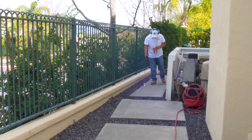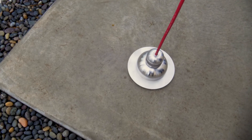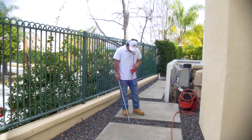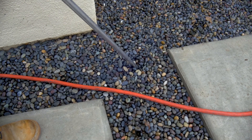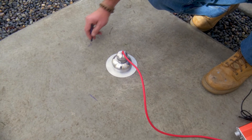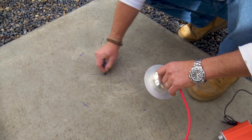He's going to be checking it, moving the deck plate about 12 inch intervals, listening for that distinct boiling sound. Then we use our soil probe for when we're not on solid surfaces — when we're listening in a rocky area. We probe it, moving the probe 10 to 12 inches each time. We heard this leak. So now we're going to get right over it and mark our location. We're going to set an X in the middle — that's the area that needs to get cut and excavated.